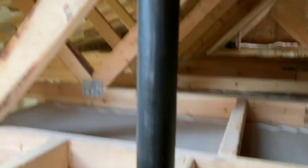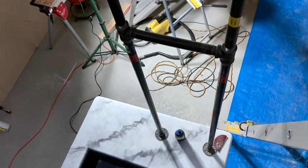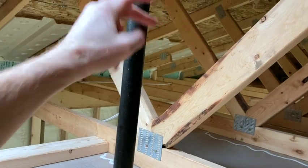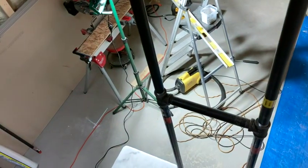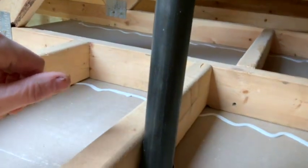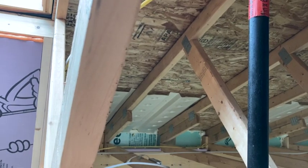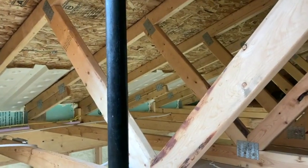That's pretty funny. But I'm up here kind of poking my head through the skylight because these two bars that go down there and connect the island where I have to run the power through, I decided since they're up in the attic and the insulation might only come to here or so, that these things will probably get really cold and that cold will transmit, because they're steel, all the way down there. Might not be a big deal, but I'm gonna cut this one off since there's no wiring through it. I'm just gonna cut this one off low. And this one I can't really cut off because we have wires running through it already. I could just put a junction box over there, disconnect them, all that jazz, but I think I'm just gonna wrap that with insulation. So that'll be my solution for that.